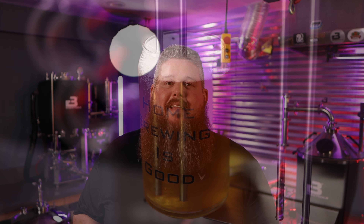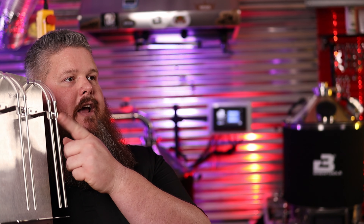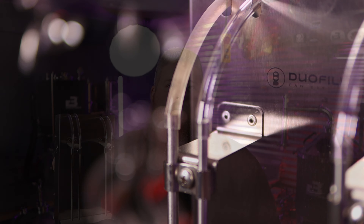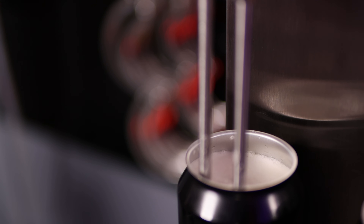Here I'm putting some beer in one of my glasses. You can see it's kind of bubbling up and foaming — that's perfectly fine. The fill hose and the CO2 hose can be moved up and down by loosening this stainless steel screw up here. What I've done for my particular cans is I have lowered the can filler down to the bottom of the can so it doesn't have a chance to foam up and create a ton of splashing. The system senses the fullness of the cans by registering pressure as it comes back up the CO2 port, so it's not filling the cans based on timing — it's doing it based on volume, which is very consistent as long as you're using the same size can.